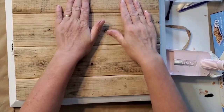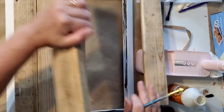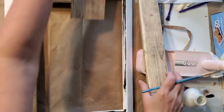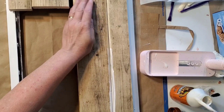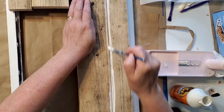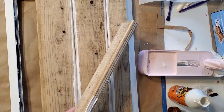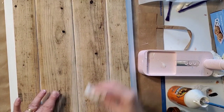Now I'm going to remove all those pieces, making sure I'm taking them out and putting them in the order I want them to go back in so I don't have any problems with the way they fit. I'm applying the glue with a paintbrush to make sure I'm getting it down even into the cracks. After I get them all in, I'll take a cloth and wipe off any extra glue so that it looks nicer.